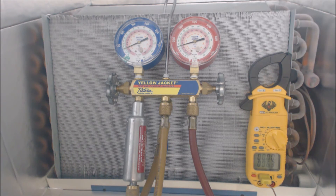That temperature can't really go down much more — it's actually still absorbing heat through the insulation. We're at two degrees saturated temp in the middle of our evaporator coil. The gauge set is actually tilted upward so it may look like a little more, but it's actually not. Our temp sensor says 5.8 degrees on the suction line out by the condensing unit — it could also be picking up heat on the way out. That's why we're able to have the multimeter reading our temperature right next to the evaporator coil, because the outdoor unit is not very far away. It just gets worse and worse until it builds a solid block of ice.